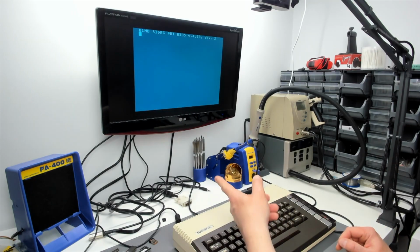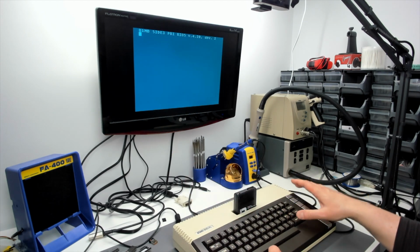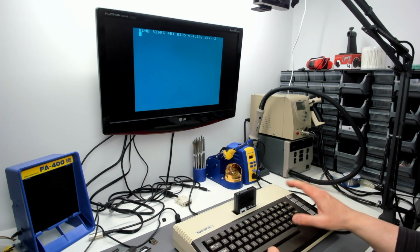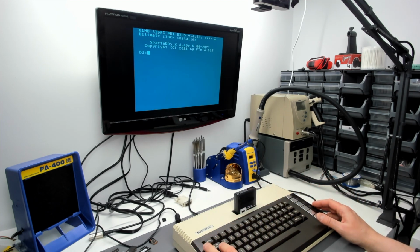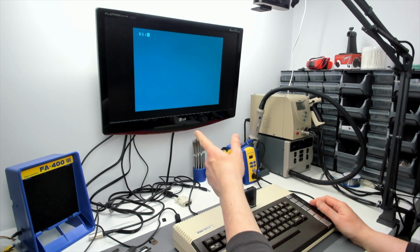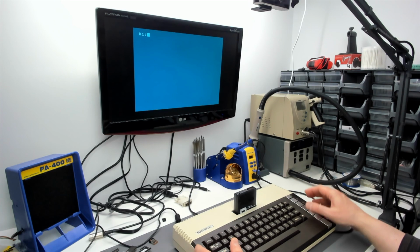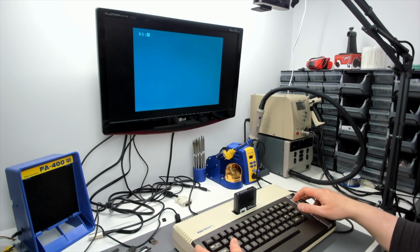So we're in what you might call legacy mode, I suppose, which is no Rapidus core loaded at all, no Rapidus classic mode, no Rapidus mode. This is just the 1.79 MHz 6502. So if we press the reset key here, it worked fine. That's no problem. If we press it again, it still works fine. If we press it a third time, it still works fine again.